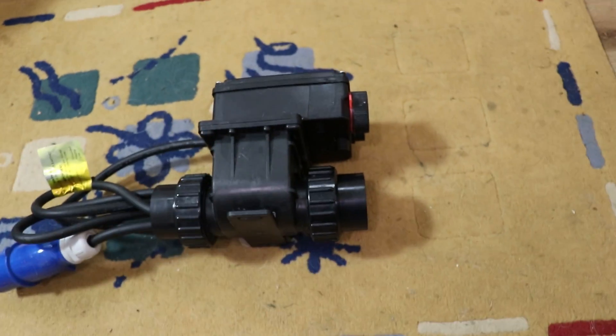This one down here is a 2kW version and I've got this on a 16 amp caravan plug. This was outside so it's a better waterproof plug, and it's a nice thick 2.5mm cable. I prefer to keep that on a 2.5mm extension cable, which is obviously a caravan cable, because you can't really run a 2kW heater on any standard extension cable - it'll just heat your cable up. Most extension cables use 1.5mm cable at the thickest, most of them use 1.25mm, which just can't cope with 2kW for any period of time. So that's my reasoning for putting a 16 amp plug on it and using one of those orange caravan cables.